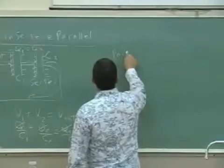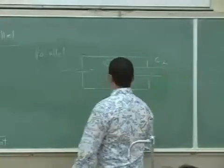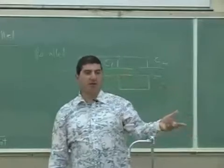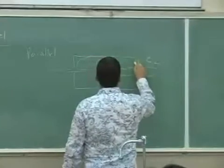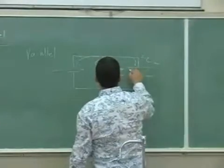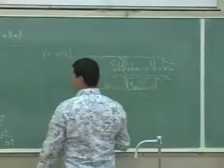So this is going to be parallel right here. This is different from series; next week we'll do resistors in series and parallel, and you'll see that resistors add up opposite to capacitors. What will happen here is the current will come and split into two, I1 and I2. So the current reaching this surface of the capacitor is different than the current reaching that surface. This will be plus on one side and minus on the other. I2 will continue flowing and then join with I1, and you end up getting I here.